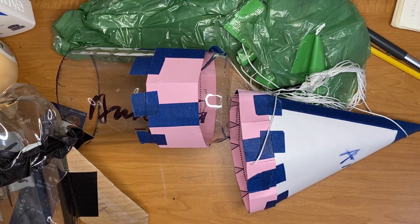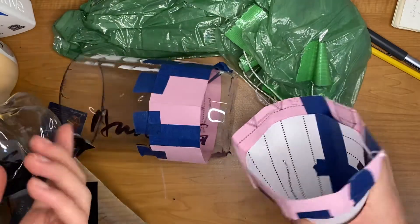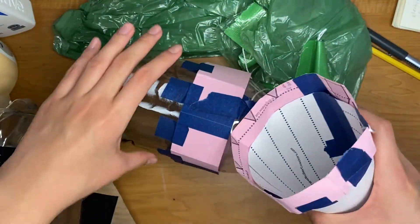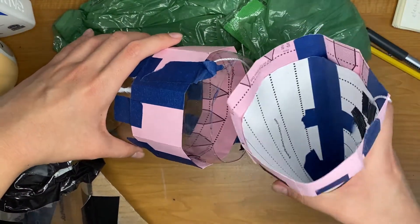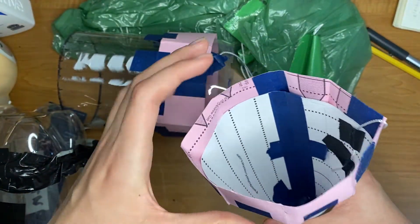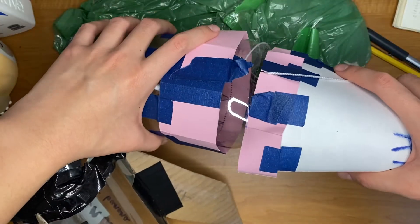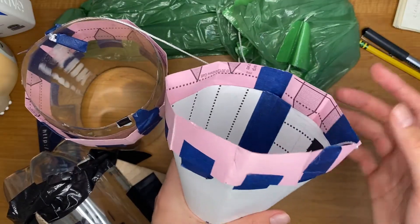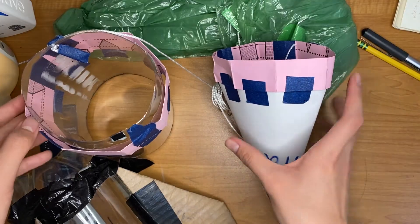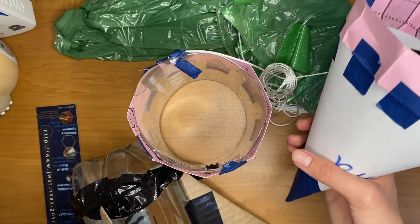Here's the part that I thought was pretty cool. The main problem is how to put the cone on but not have it fall off too soon, because the cone has a circular shape and the bottle opening is also very smooth and circular — it'll just fall out pretty easily. So what I did was make a ring around it. It's slightly angular — it's an octagon, eight sides. I have two of those that lock into each other. The reason I did not pick a triangular-shaped ring is because I feel like it's going to lock in too much and not slide off easily. And this is pretty close to a circle, so it gives some movement and room to slide. The main idea is that it would insert, lock in a little bit, and then fall off.